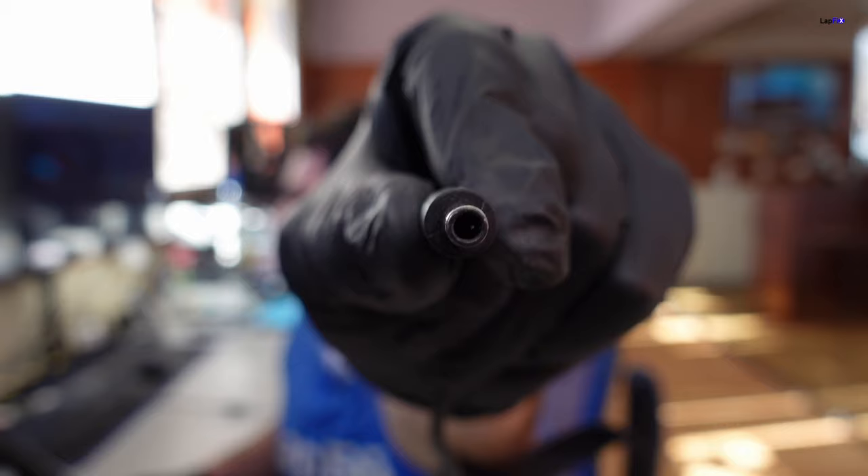This one's a little bit interesting because there actually is a problem with their AC adapter in the first place. If we look here — I might go to the microscope — this is the original one, and the pin is actually a little bit bent. So what that can mean is, because it's not making full contact with the DC jack, that's probably causing a problem with charging. It probably thinks there is a problem with the AC adapter or there's another problem going on. So it's not getting that full contact, it's not going to charge the battery. We swapped it out with a good one and we still have the same problem, even though we have a clear indication there is a bad AC adapter.